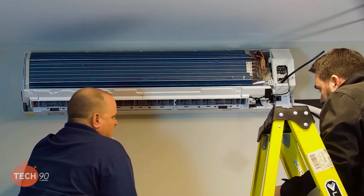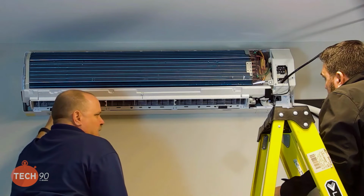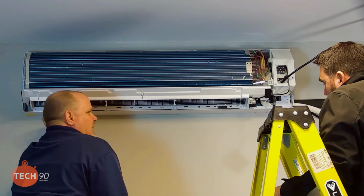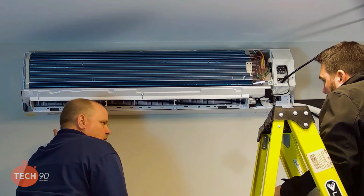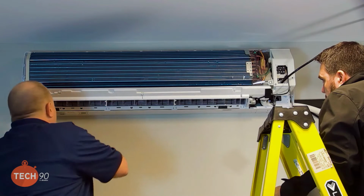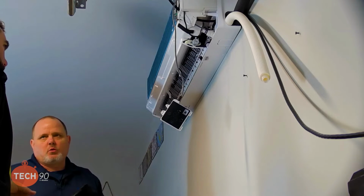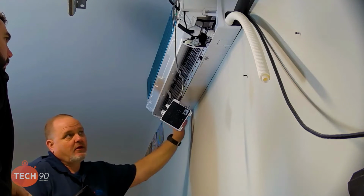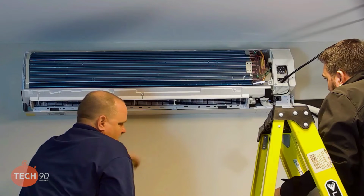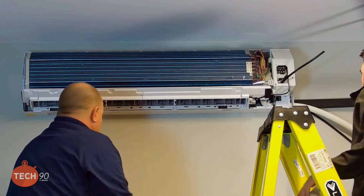And then lastly, with the Mighty bracket, when they're hanging on there, if for some reason we allow that to put too much tension on that and bend those brackets downward a little bit, you may have to bend them brackets back up a little bit so the bottom actually locks in tight and pulls it to the wall. And another thing what Daniel was saying was, some guys will come back and put silicone around it and it just looks terrible. You shouldn't need any silicone around it.